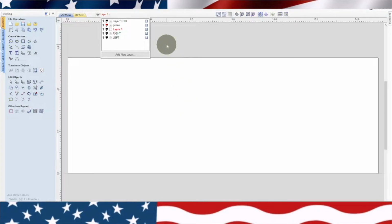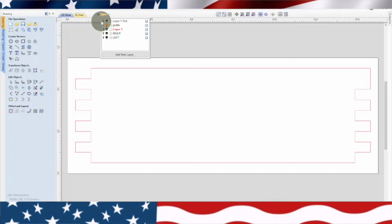Now this one's a little bigger than the back and the front because the box is 12 inches by 14 and a quarter. Now right here, I'm going to show you the profile of the side. Now you can see the box joints are exactly the same, but they're opposite. So this is the front of the box up here. And the reason this one's fuller is because the lid comes all the way out here to the edge, and I wanted to be able to have a side of it. So this is the profile cut, and we don't do any allowances, we just cut it out.